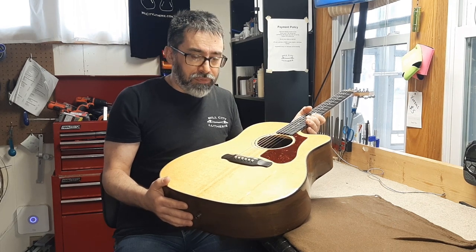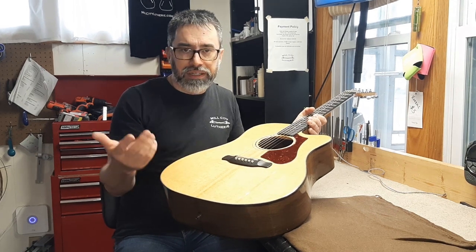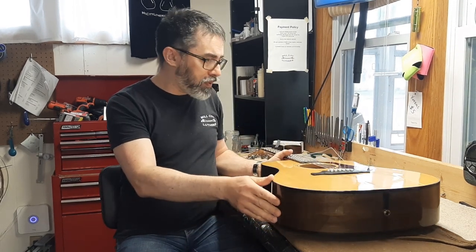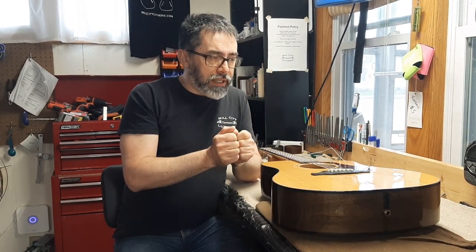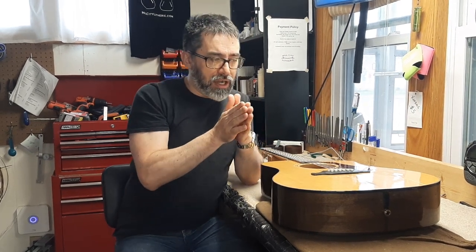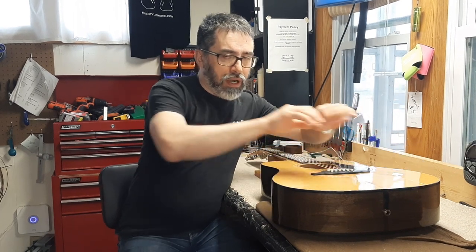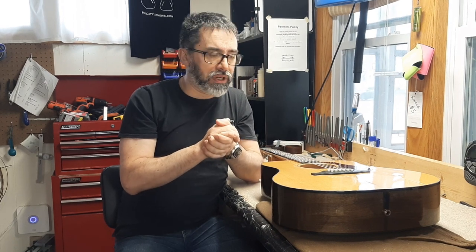I did this a little more on the rugged side — it's kind of what I discussed with the client. This is a guitar where the crack had been repaired before and it had come open again a second time, so he wanted to make sure it was done nice and sturdy. Normally the filler strip I put in wouldn't be quite as tight, but seeing as how the wood around it is wanting to pull away, adding that little extra tightness means the filler strip is also pushing on that wood. Add a cleat inside and everything should be really solid from here on out.